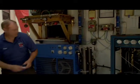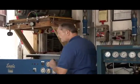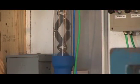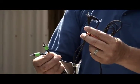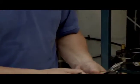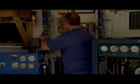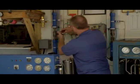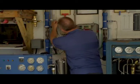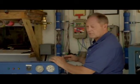So now we'll plug in our sensors. They're both oxygen sensors, so it doesn't matter which one plugs in where. Then we have our oxygen and helium cables here. They're also interchangeable. We've got them color coded and marked. The green ends are for oxygen, which is sensor number 2, and the other ends are for the helium, which is sensor number 1. So the green plugs into sensor number 2 and color coordinates to the green. And then the other cable plugs into the top sensor, which is for the helium.